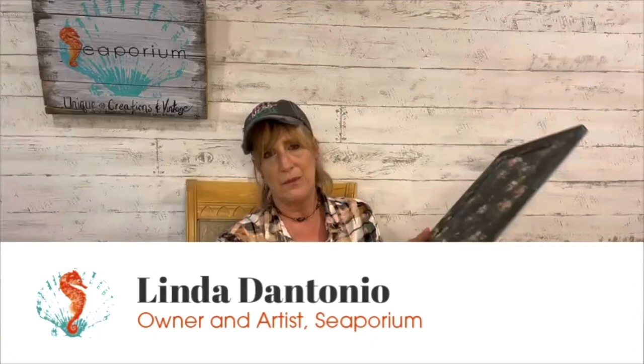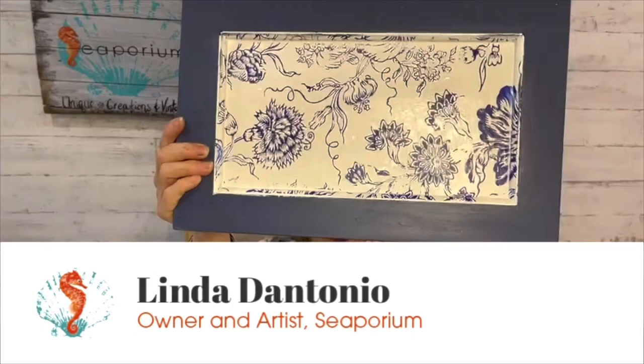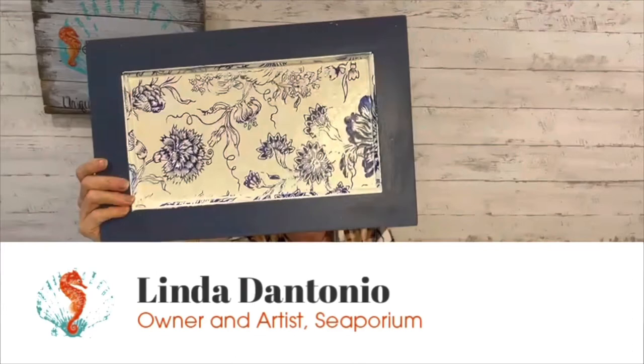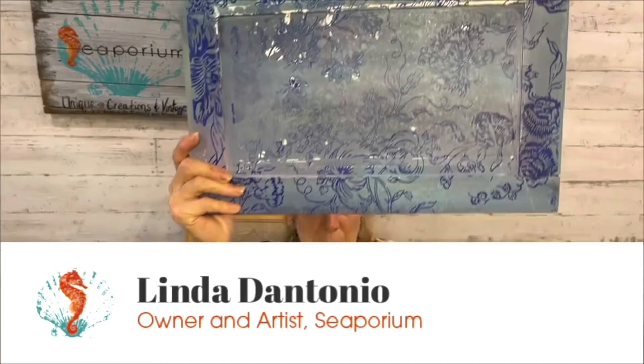And then here is the indigo floral. This was my absolute first application. It came out drop dead gorgeous. And because it's the actual paint, when you get little gaps, like here where the flat meets the molding, I did have a little gap. The varnish is still drying, but you can activate your paint with a fine tip brush and actually make the little mishaps and seams disappear. Look at this.